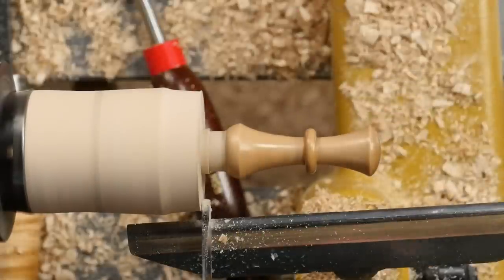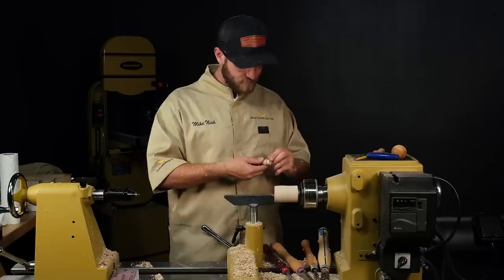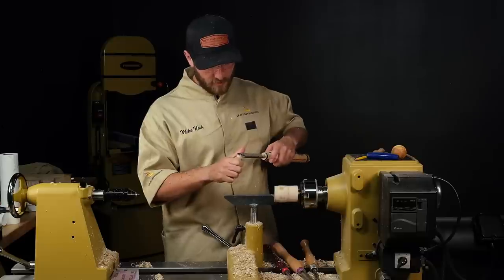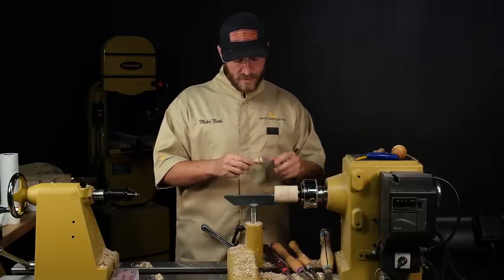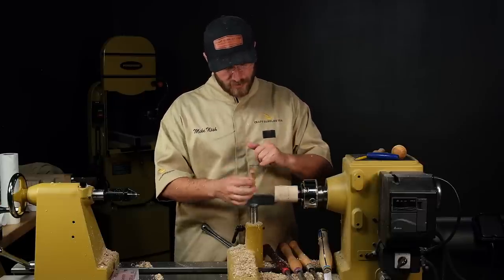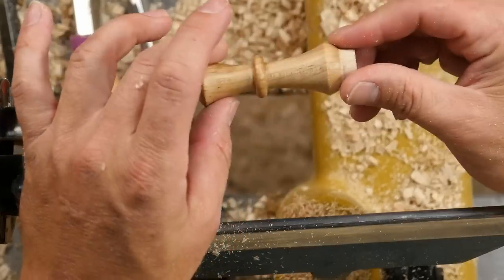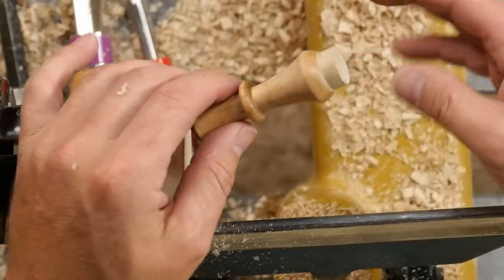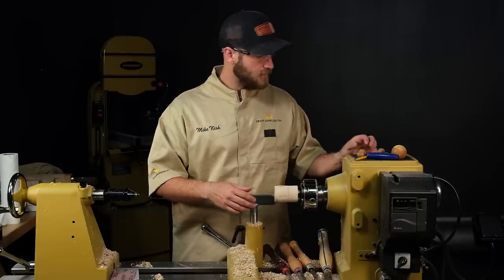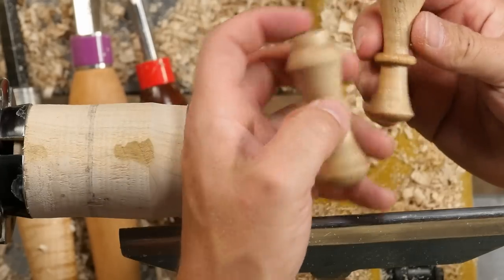Now we can go ahead and part this off. I'm going to be parting one-handed here and then just catching the handle as it comes off. Got a little bit of nub there in the center — just going to chip that off with my skew. So that's the handle done. The handle looks really nice — we've got a really good-looking turning on the end, got rid of that center point, nice bead. It's a little off-center, but it's almost far enough off-center it looks intentional. If you screw up on the bead, no worries — worst case you can always turn the bead off. I think this one is a lot better weight and shape than the other one. So now we're going to turn the top.